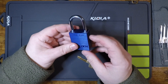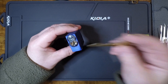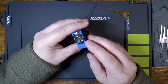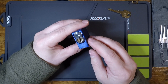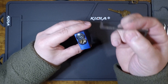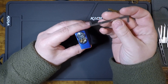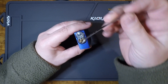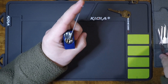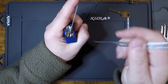Let's go ahead and see what's inside, but first we're going to have to pick it open and see what it takes to get through this seven-pin core. The keyway here is still pretty open. There's some warding, but it's not going to obstruct your ability to get to those pins, although the shape can make it slightly awkward to get a top-of-keyway tensioner in there. I'm going to use this top-of-keyway tensioner from Covert Instruments — this is actually from the Covert Companion Turner expansion, not in the Covert Companion, and that's a subject for another video. So we'll fit that right in the top, and then I'll go to my standard Sparrows Tron pick in .025. Let's get started on this.